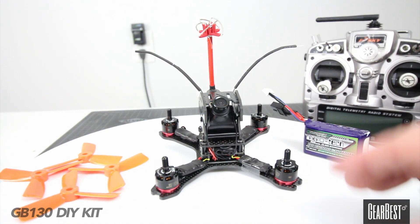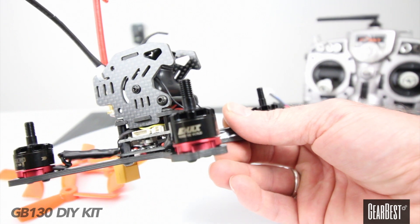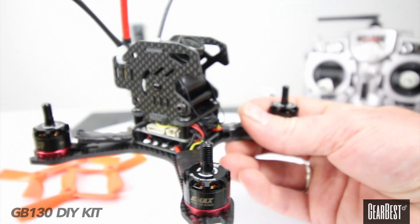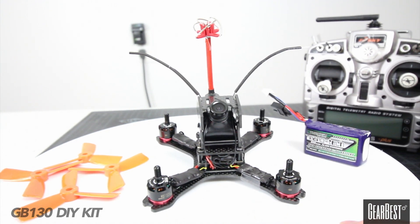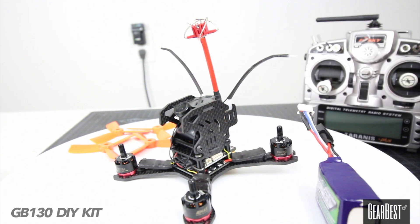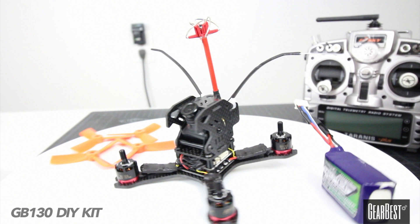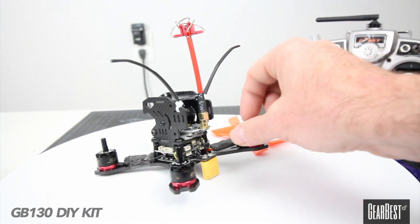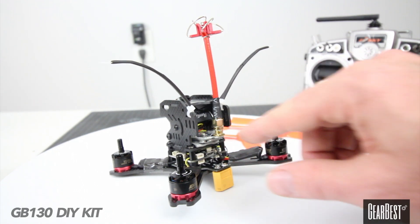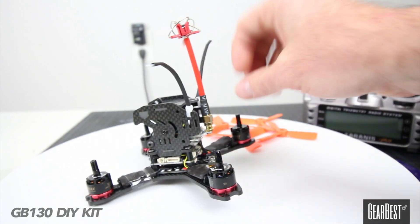The motors on here are also super high spec — little Emax motors. These red bottom motors are pretty much what's predominantly popular right now. They're 1306 4000kV, super beastie with a really high power-to-weight ratio for a little 130 quad. You probably noticed also how much camera tilt I was able to get inside this frame — I'm almost at 60-plus degrees, almost vertical. It's a pretty awesome little frame. I've also got my VTX in the back, which came along with it, and that's a 200 milliwatt, which is really nice.